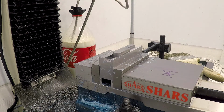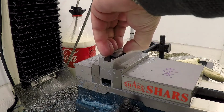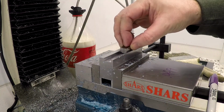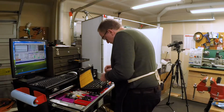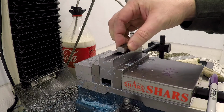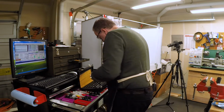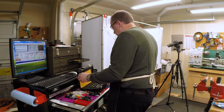And if we want to go to 501, we need to take an extra thou off of each side. So I'm going to go pump this through Fusion one more time and set it up to leave -1 thou, and that should put us right at 501. Boy, that's nice. Yeah, but with the extra thou, it goes part way down and will not go the rest of the way. Okay. If the slot ends up being 502 instead of 501, it's not going to hurt anybody.